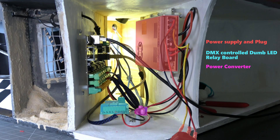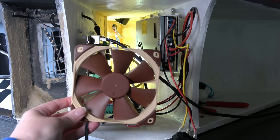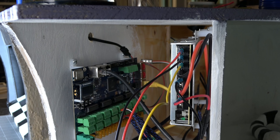The purple is a power converter because the dumb LEDs take 9 volts instead of 5 volts like the rest of the lights. The panel you see in green is the smart LED pixel controller. This is what is sending information and power to the lights, telling the lights to be on or to go on and off in a certain pattern or to change colors - so it's basically a little computer. All of these are going to work together to control the entire house. Where you see my flashlight moving around in the center is where all the wires are going to come down from the upper house into the base and go to these panels.